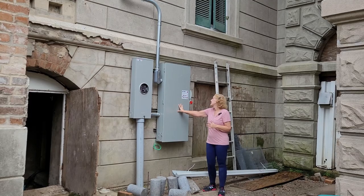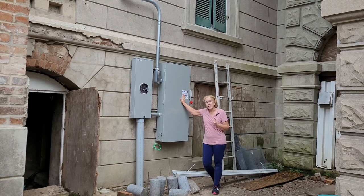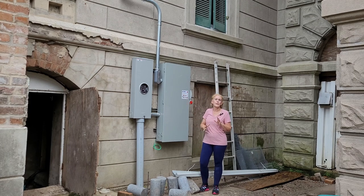If you notice, this is a whopper panel — a 400-amp circuit — and we may actually add even another 200-amp second service just for the apartments. This is a big house that's going to have 35 tons of AC and heating in it; it needs a lot of power for modern conveniences. So this work was done within a month or so of buying the house.